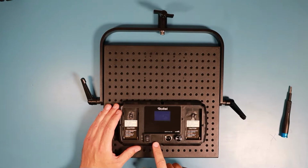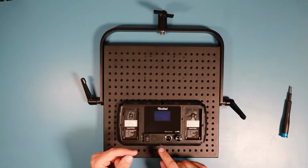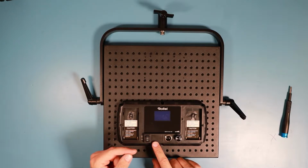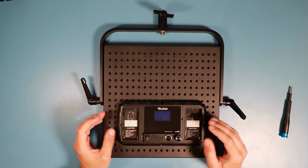There's actually a piece of plastic glued in here from behind, so this is not complete molding. The rectangle inside here is separate, so my guess is that this is a position for another kind of switch. So on my other light, I removed this plastic part and I glued a grill in this position, so there could actually go airflow through here. And also on the voltage regulator or the current regulator for the LEDs, which sits under here, I stuck a small heatsink on it, so it gets a little bit more cooling, and this resolved the overheating issue for me completely.